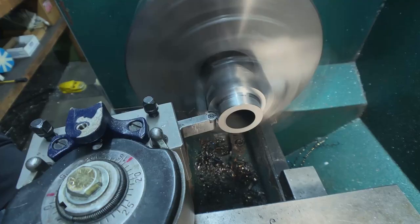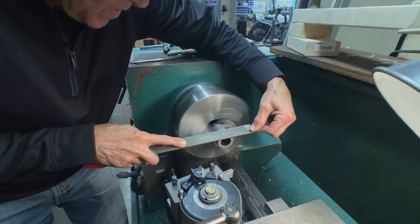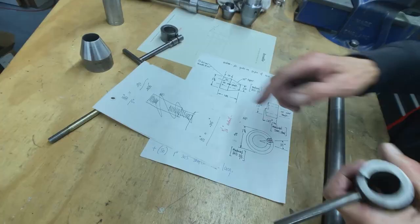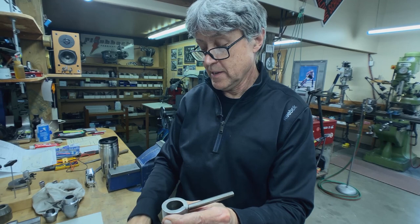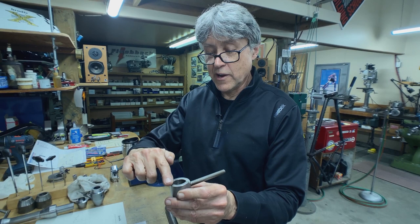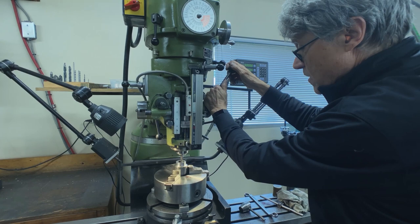Switching tools. If I had a CNC, I could ramp it down, but I don't have a CNC. So what I'm going to do is a series of little steps — every 10 degrees I go down five thou. It's going to be steps the whole way around, and then I take a file and file it so that it matches that taper. That's the goal.